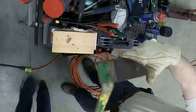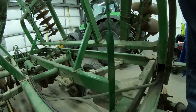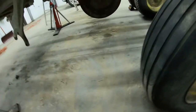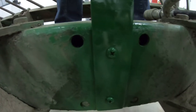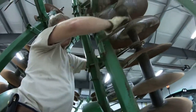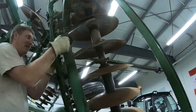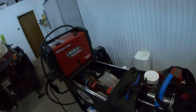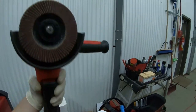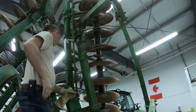We've assembled the mounting plate. Earlier today we also mounted a slow-moving sign with a little bracket I home-fabricated. All we did was drill holes, tap the screws in, and put two screws into the frame — using thread lock because we do not want that falling off. I've dry-fitted the scraper plate now. I'm going to come along with our Milwaukee battery grinder with a flap disc and just remove some of the paint to get a nice clear area where we can weld. You do not want to remove too much material.